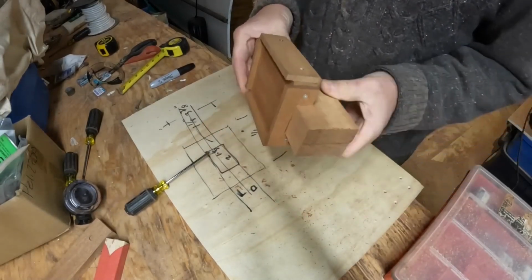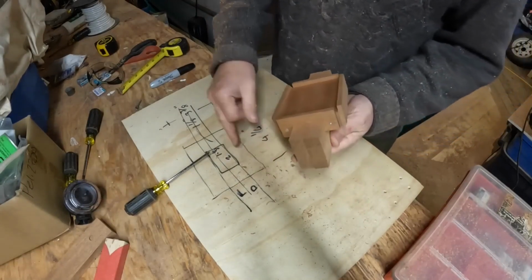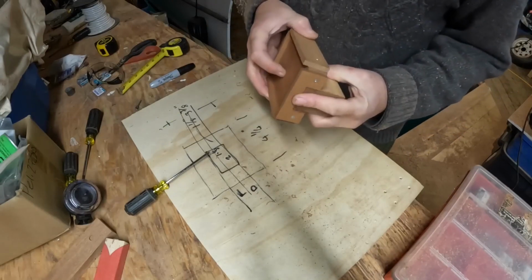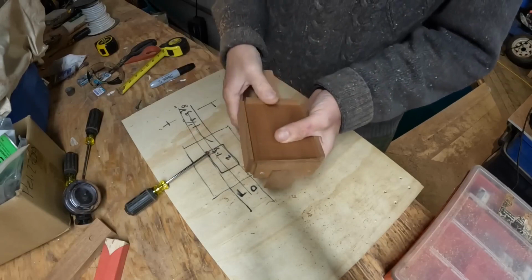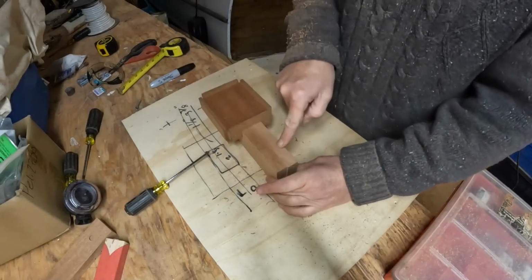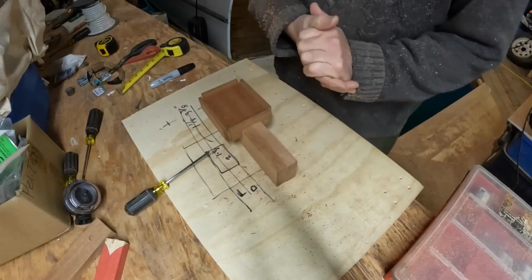Nice. Now, there's an added really neat feature of the particular dimensions that this all worked out to, and a 1/4 inch fence piece. When I slide that right against the end, or wherever the frame will be, it actually perfectly positions it for where I want the hinge in terms of the offset from the bottom of the rail. Very, very pleased with that.